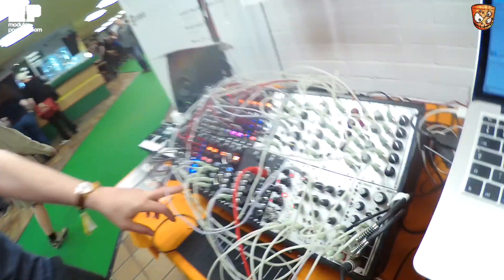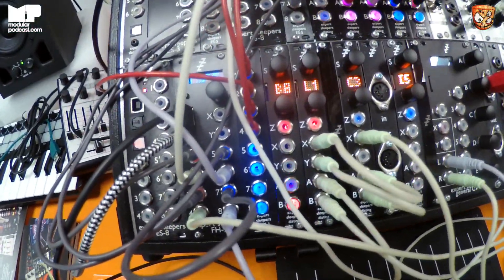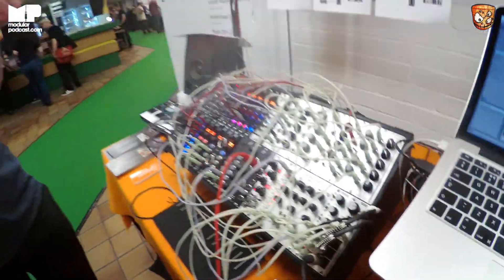It's expandable as the FH1 was — with the FHX1 expander you get a total of 64 CV outputs. I also realized on the plane over that I can do a gate output expander as well, so for less money I can make an expander that will just do clock outputs. I think I can easily do 192 clock outputs, triggers, resets, start/stop — any output can be a clock or a start/stop trigger or part of a MIDI to CV conversion or directly controlled from a knob.